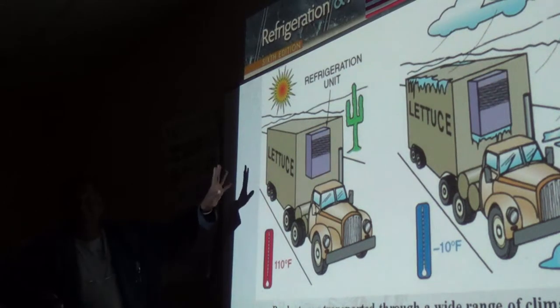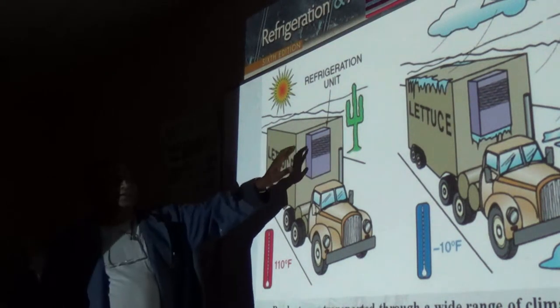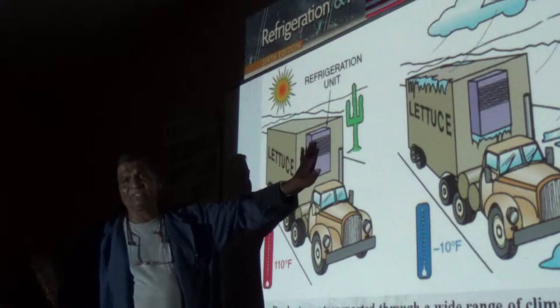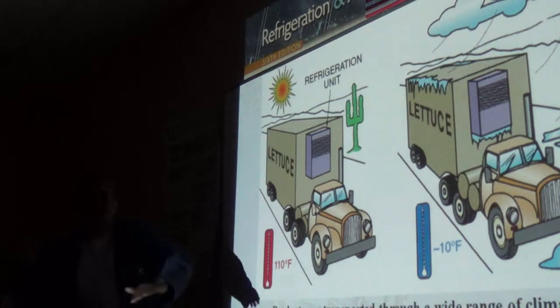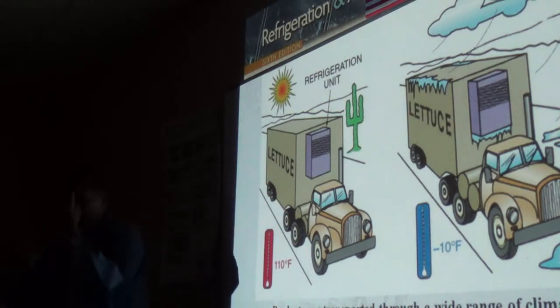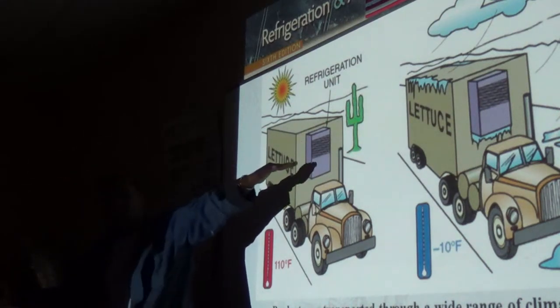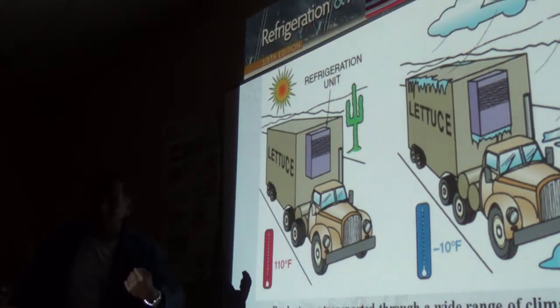You would think you could just have louvers that open up, let some fresh air in there when it's minus 10 degrees. You get a little free refrigeration. See, one of the things is, if you do that with the louvers, the speed at which these trucks go, they may break that louver. You may not have the strength, because those louvers are actually operated by the pressure in the refrigeration system. So it's operated by refrigerant. If you have a lot of back pressure from the air coming into that louver because of the speed of this truck, then you get back pressure in the refrigeration system.